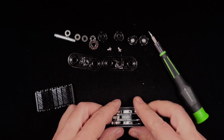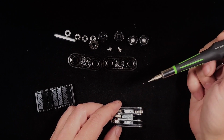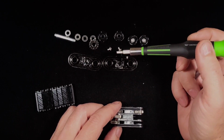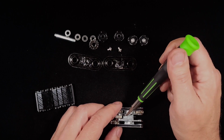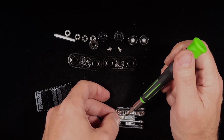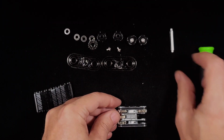That's another thing. One of the main reasons they probably put this set screw in here like this was to make manufacturing easy, not because it was an adjustability feature. That's my first guess, because otherwise, if they just had a blind hole here and had to put a spring and a ball in and then somehow hold that gear in place while they hold the other two gears in place and thread this through and everything, that would be a real hassle.